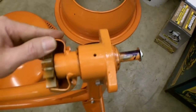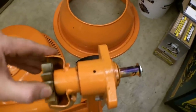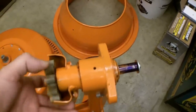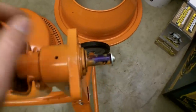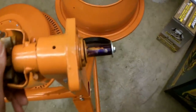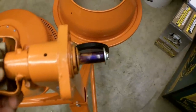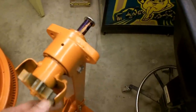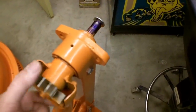I noticed something — see how difficult this shaft is to turn? There are a couple of bearings in there and I think they've been pressed on too tight. I'm going to take the screw out and hit it with a soft, non-marring mallet to see if I can free it up. It almost feels like they just jammed those bearings in. They didn't even clean the layout die off when they cut the key slot for the pulley — still had blue die on it. I hit it a bunch with a hammer and it helped, but it's still stiff with a hard spot. Hopefully it'll wear in.